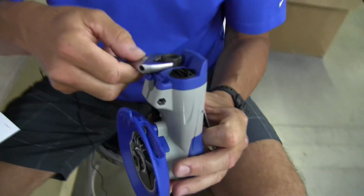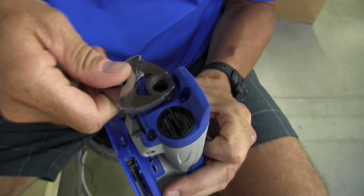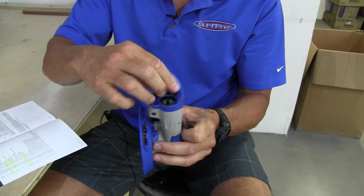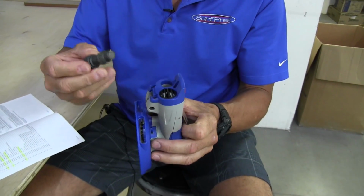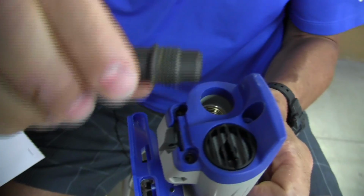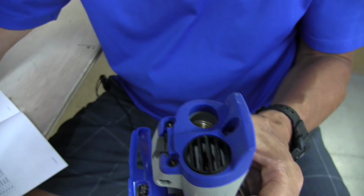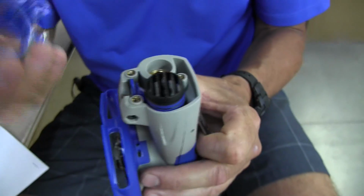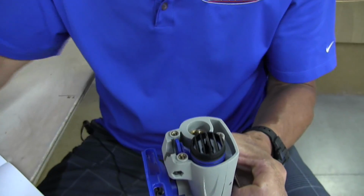Next, you can take a crescent wrench, and we need to take this air inlet nut. We're going to unscrew this. We're going to pull this off the back. There's going to be a thin layer of probably Loctite on this male thread, so it might be difficult. Once you've done that, you're going to rock this back piece and pop it off, just like you have here.